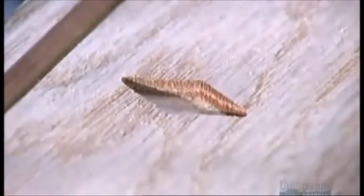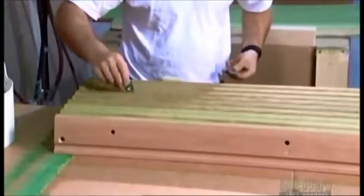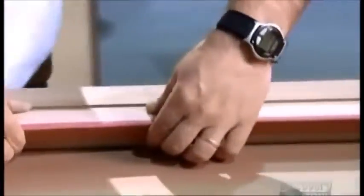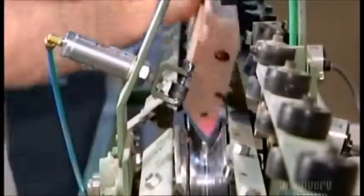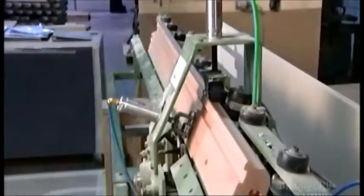Six wood components, called rails, will surround the playing surface. They have diamond-shaped carvings that'll become visual markers for the players. After spraying the rails with glue, a worker inserts 18 metal nuts, which will be used later to secure the rails to the playing surface. He attaches rubber strips along the sticky rails, which are just over 1 meter long. The rubber will cushion the balls when they hit the sides. The rails then pass through a press twice to ensure the rubber adheres.